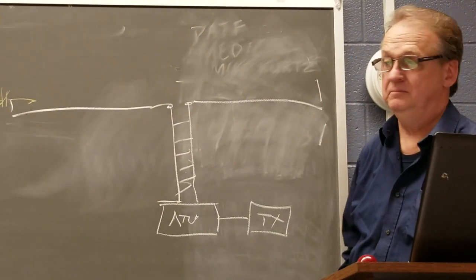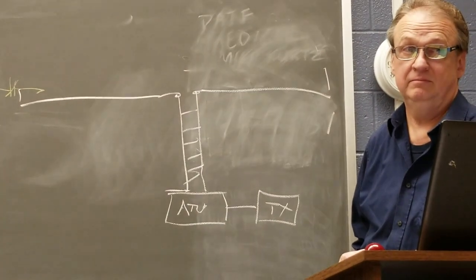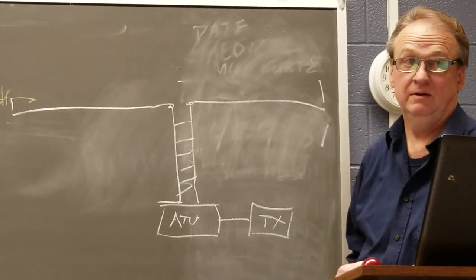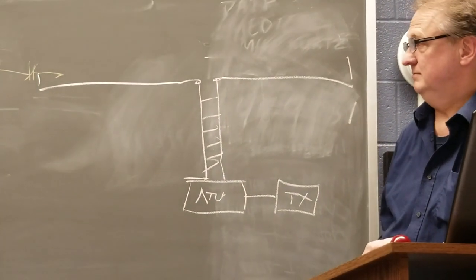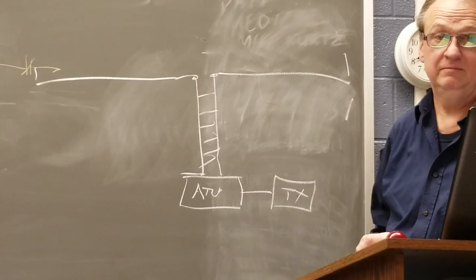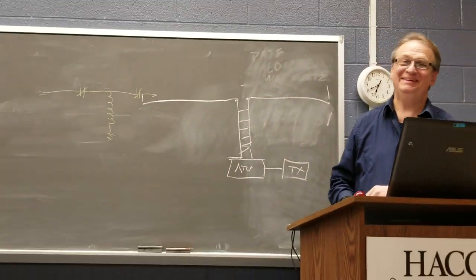You run a piece of coax and try this, you're going to hear the toaster go off, you're going to hear the alarm clock go off. You get no feedback in the shack, in the house, off of balanced line. It's a perfect antenna. And using the magic of the Pi network, or the LC, through the ladder line, you transfer all the power. None comes back. But maybe, can I take a second and back up? Yeah. The perfect antenna. Turn around and show him.